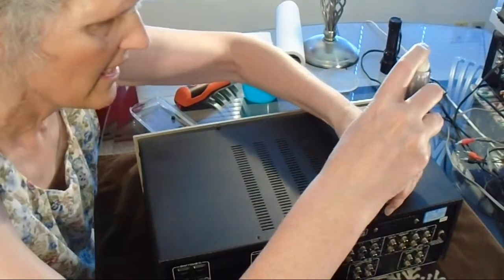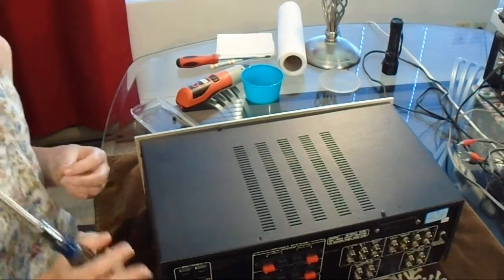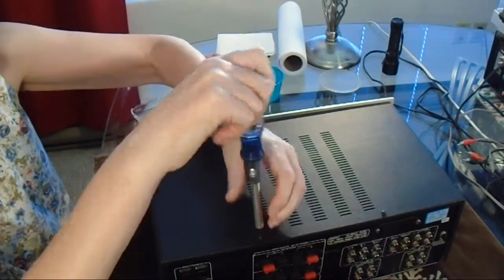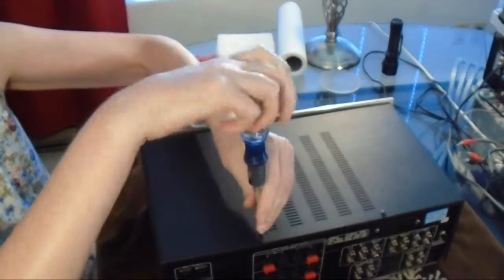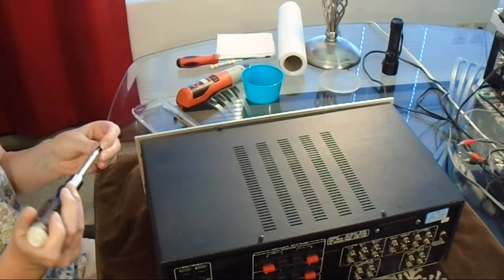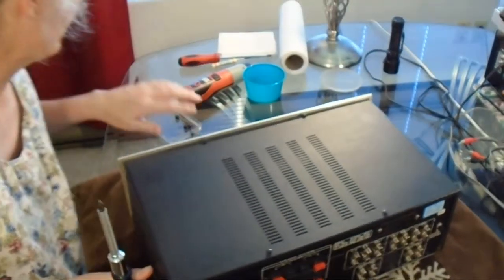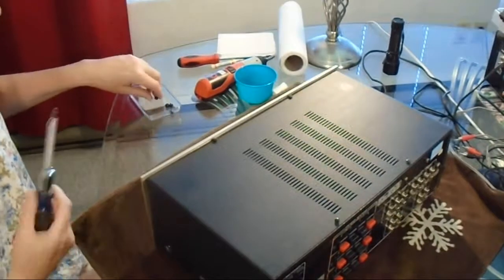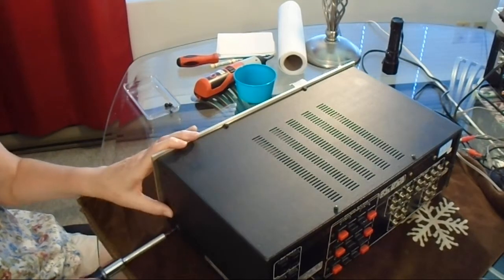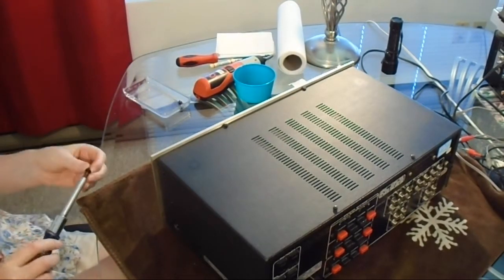What it actually does is you have to hook an amplifier, the speaker output from an amplifier, into the back of this unit where the speaker inputs are, and then if you want to listen to headphones, this unit will take the signal coming in from the amplifier and step it down so you don't blow your head off, and that's how you get your headphones. That was really cool to find out, because I thought you wouldn't need an amplifier to listen to the output from this unit. You could just plug in headphones and hear whatever input you're using. But he says no, it doesn't have a headphone amplifier built into it.